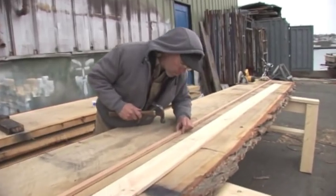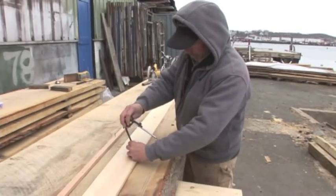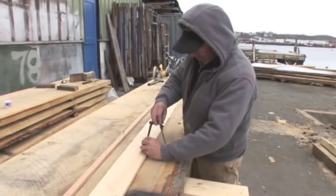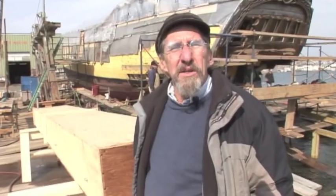The process generally is that we take a 2½-inch white oak plank. It has to be spiled, which is making a pattern, and then we cut that plank out. The frames have to be flattened, or what we call dubbed, and the plank is ready to go on the boat. First, we have to steam many of them because a lot of them have a bend or a twist in them. This 2½-inch oak is not very forgiving unless some steaming is done to it.